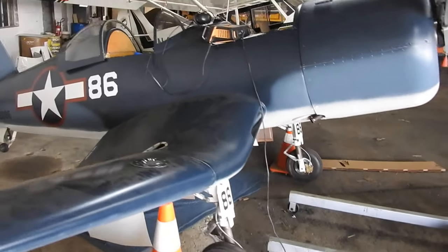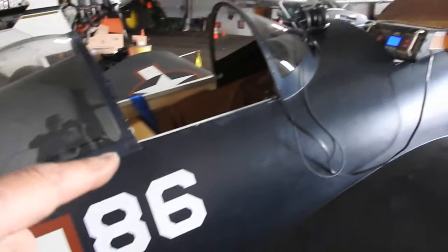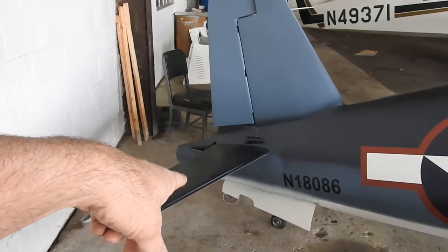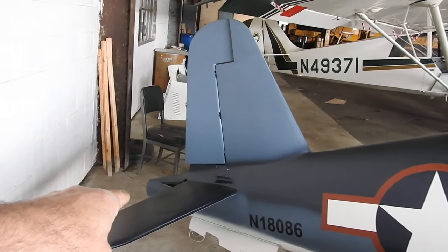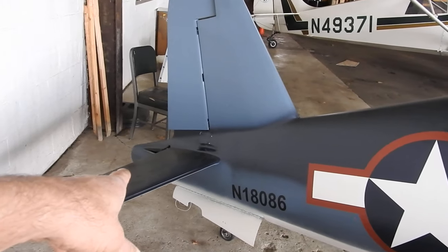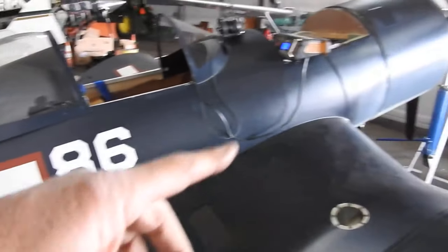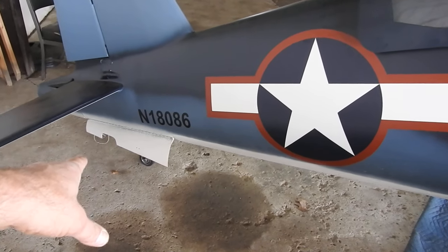The only thing I have is the red light. I got the tail wheel motor disconnected — I pulled the wires on the relay so they wouldn't retract the tail wheel. The problem is when you pick the airplane up like this in the front, it puts a lot of weight on that tail. At home I have a set of sawhorses — I'll pick this thing up and it would be three or four feet off the ground, one sawhorse under each stabilizer with some foam rubber to support the weight. So I just disconnected that; you've seen that working, so I left it unpowered.